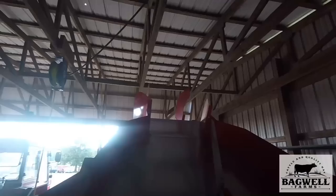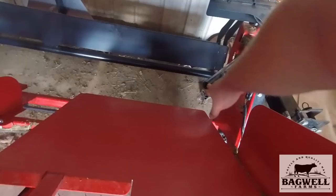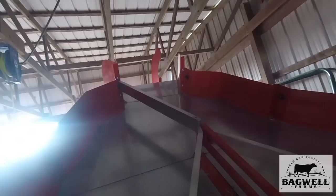Your hay comes down, it comes down this slot, goes straight down, and it's going to hit this bar right here on the end corner. That bar is going to catch that end corner, push it out that way, and allow it to slide in right over that — that pushes back on the back side of the bale, which is what turns that bale sideways for the 10-bale pattern. Then you have two more bales make it up here, and the second bale that comes down straight catches this and opens that gate so it flows right down in there the same way.